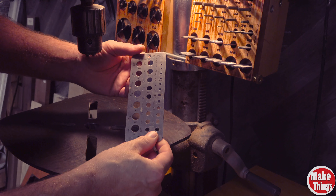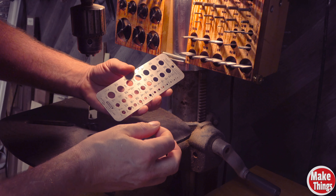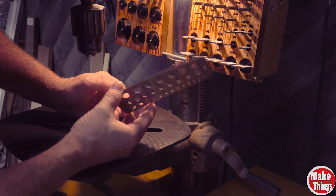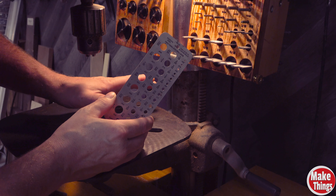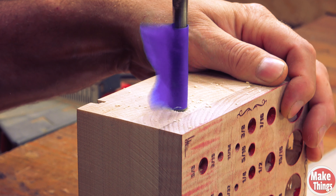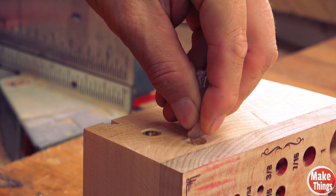In a past bite size video, we talked about using one of these drill gauges. They're really nice because not only does it help you find the drill bit size you're looking for, but if you have a screw, you can insert it and it'll tell you which size drill bit to use. I have one of these, but I have three cases - I always lost it in one of the three cases. So I decided to add magnets to the side, and now I can just easily attach it to my block. I'm using a couple of rare earth magnets, three-eighths of an inch. I added epoxy before adding the magnets.